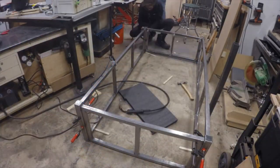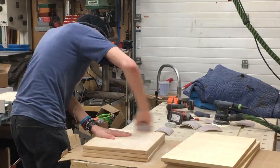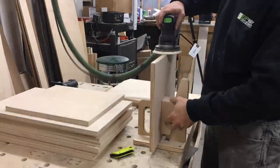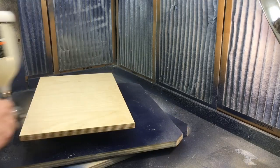After the frame was welded up we built the drawer boxes and cut up the end panels. Polish sanding the edge of the Baltic birch plywood is key for this type of material to look its best. Proper surface preparation and sanding can make all the difference in the world and will make your finish process much easier.